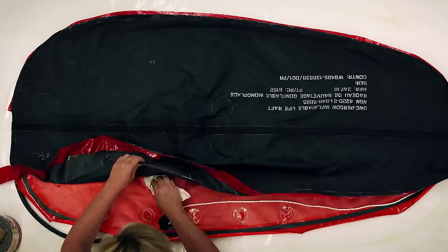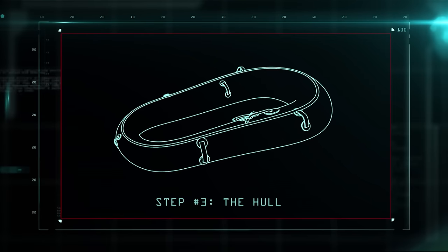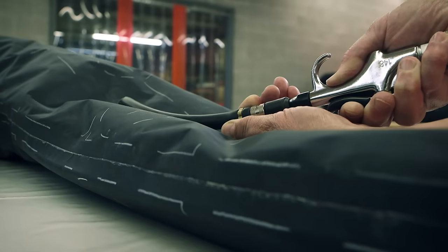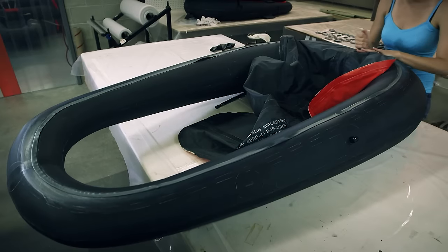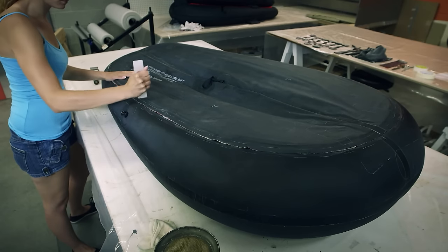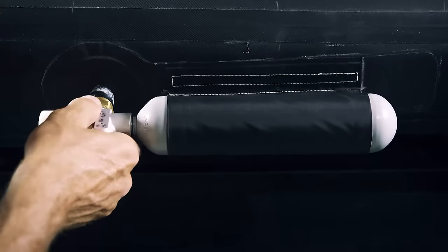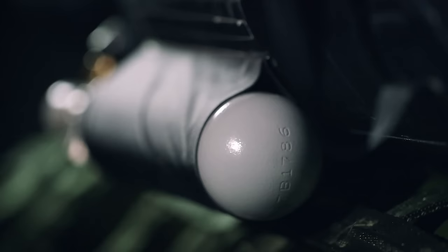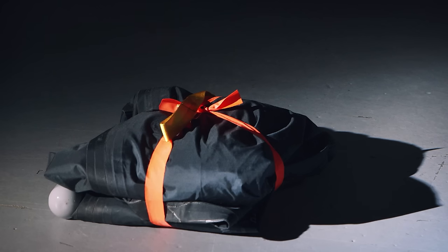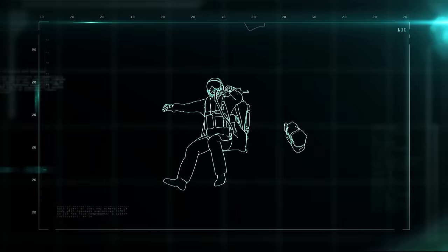The two layers of floor are attached, leaving a tube exposed that will be used for inflation. A rubber inner tube is inflated and attached to the floor of the canopy. While the top of the raft is orange for visibility, the bottom is black, making the life raft less visible to sharks. Next, the rapid inflation system is installed. Each raft is fitted with a carbon dioxide cartridge hooked up to the valve on the side of the hull — it'll be used to inflate the raft once it hits the water. Now the raft is ready to be tested. When it's folded up tightly, it'll be small enough to be fitted in an ejection seat. And in the event of an emergency bailout, it'll be ready to deploy in seven seconds flat.